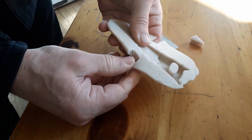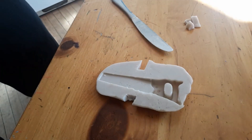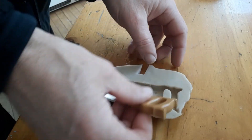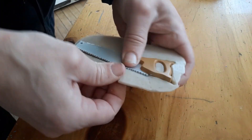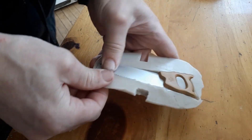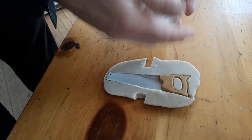Don't throw those cut pieces out — they're reusable for a new mold and you can add them to other impressive putty anytime. Now we're ready to make the second half of the mold. I'm going to put the original shape back into the mold and reheat some more impressive putty to get it ready.